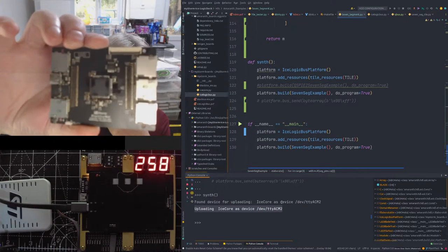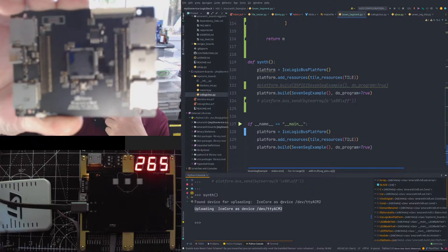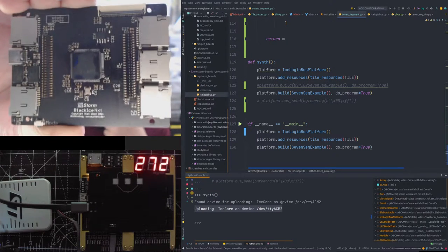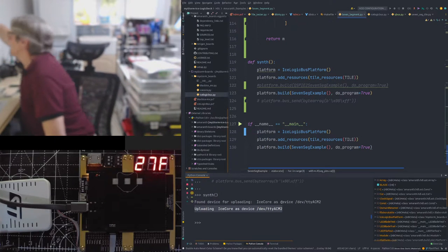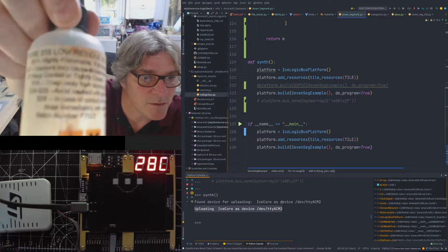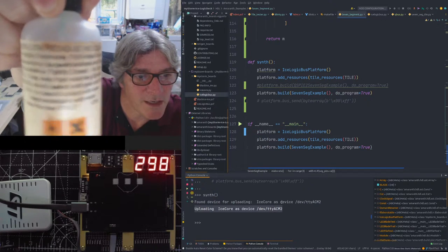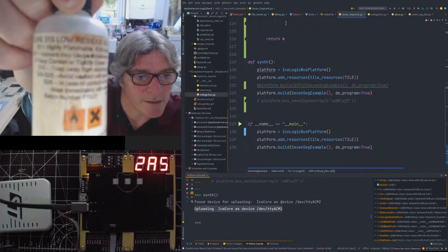It's tacky flux, but it's really, really messy, and you wouldn't want to use it for production. I prefer using water-soluble flux. The other one I do use is Wharton Metal stuff. I love their solder as well, although it's difficult to get their stuff now. I did actually locate another company selling their stuff on Google earlier, so I might try those.